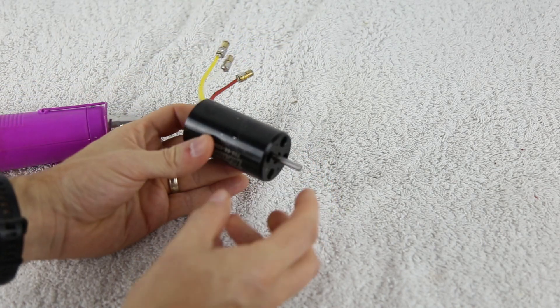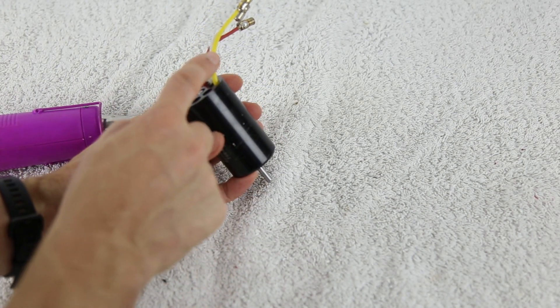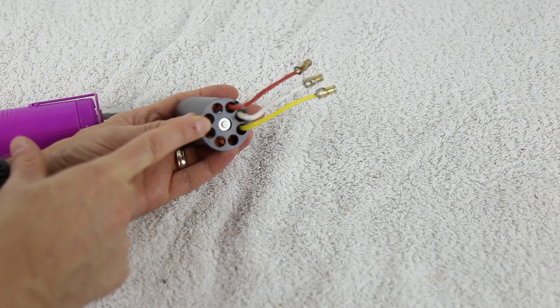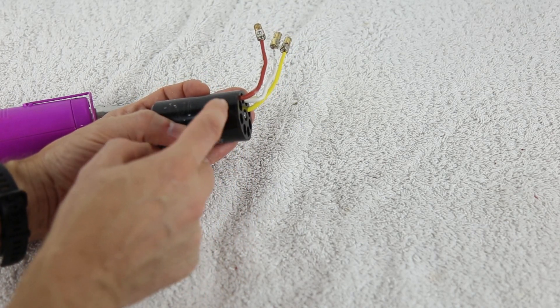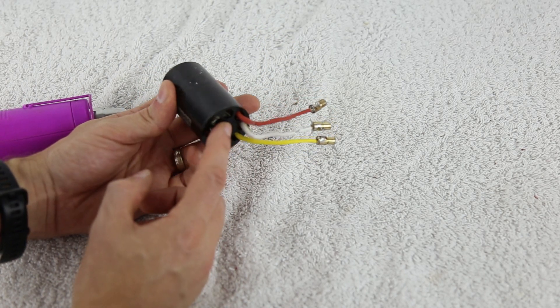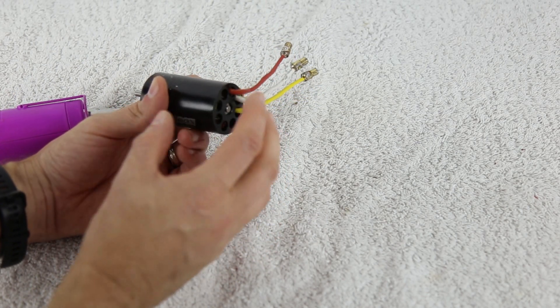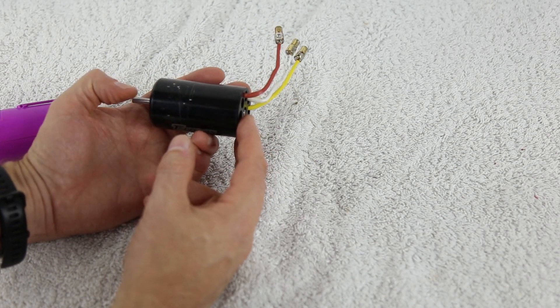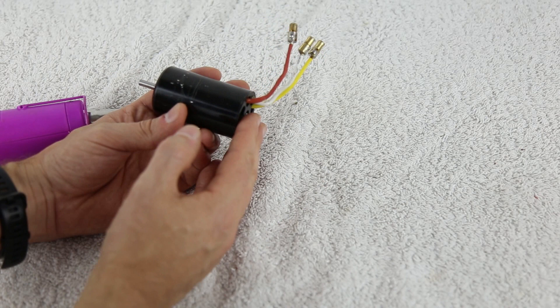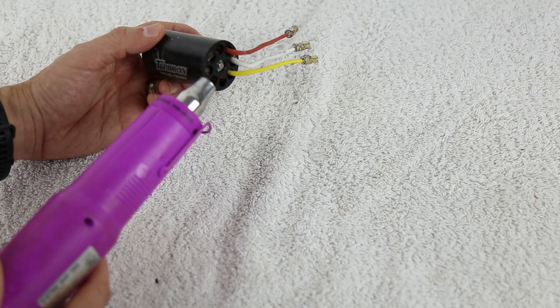Let's go ahead and jump into disassembly to find out what has happened. One of the first things we are going to do to get the entire rotor out is heat up the end bell at the back of this motor. This motor looks like it has the end bell fastened on with some sort of lock material and then press fit onto the motor can. Typically, these types of motors do not like a load being placed in the pusher prop direction, as the entire end cap would have to bear the force and could pop loose under sudden pressure.